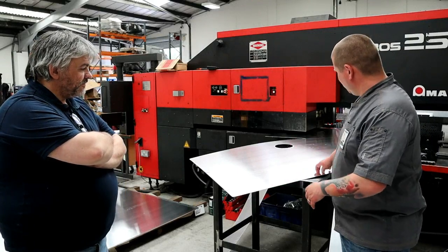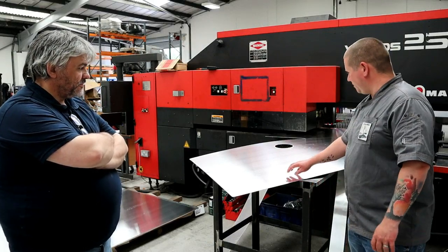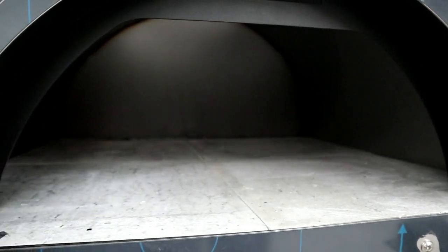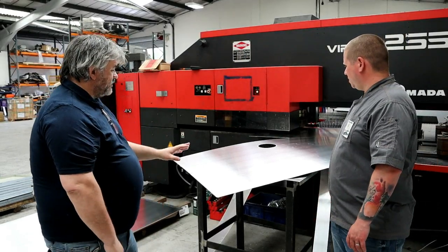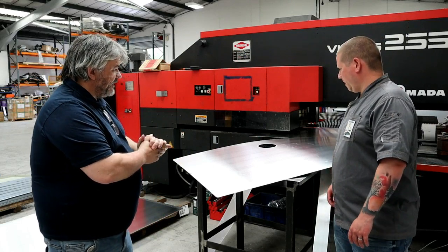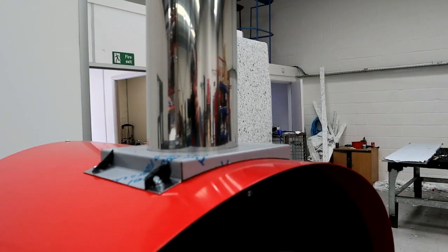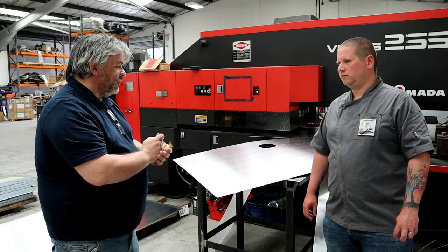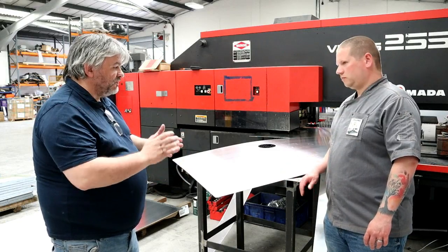So you've just seen this marvellous machine do it and we've ended up with a cover, which is what you'll see being rolled. What's this one for Dave? It looks big. This is actually an Apollo cover. It's the same process for a Vesta. The offset you can see at the back will in a minute be a Vesta, and that's the one that will be rolling. So that's the Apollo, that's the Vesta — the Vulcan's all the same procedure. Everything just grows a little bit, on the same style — the Vesta, the Vulcan, the Eterno. They're just stretched on the height, width and length. It's 2mm cover on all the ovens — 2mm base, 2mm front, 2mm back — and the inner oven, all the same materials.